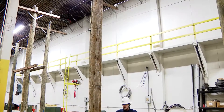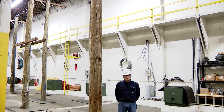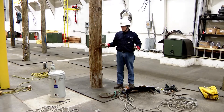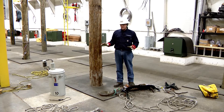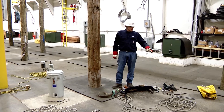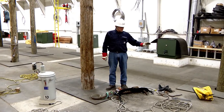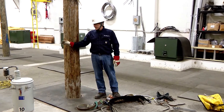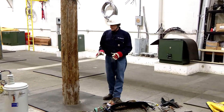This is a demonstration to hang an overhead transformer on a wooden pole with rigging equipment. I pre-inspected all my rigging equipment — everything is good. I have my bolts, my short bucket, hand line, all the ropes I'm going to need, and rope blocks. Everything's good there.